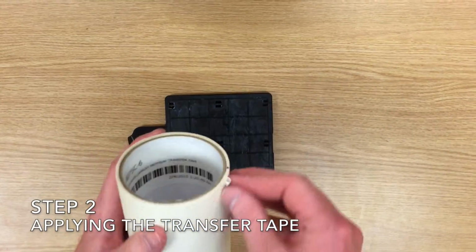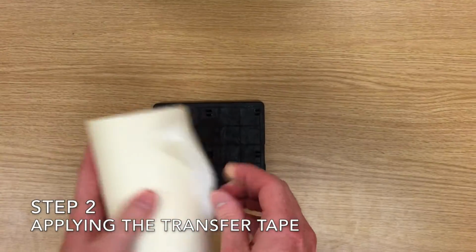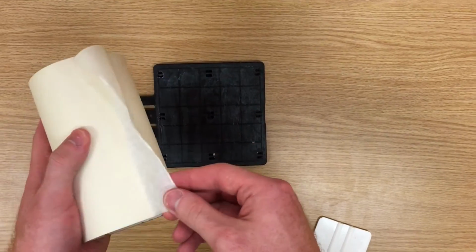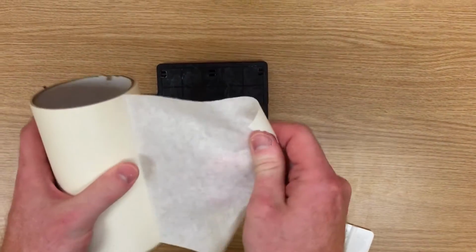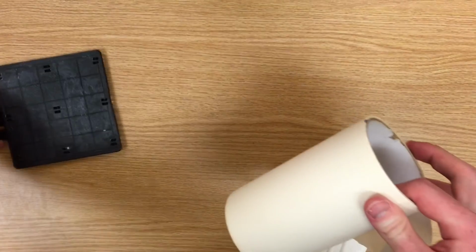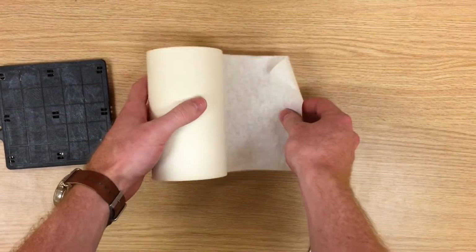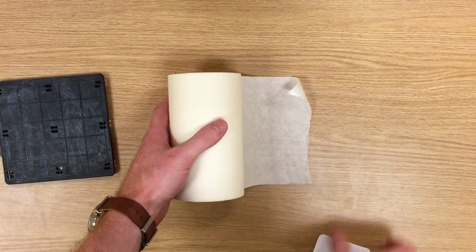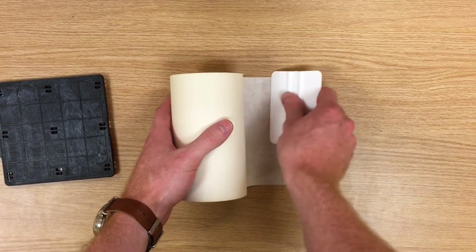Step 2 is applying the transfer tape to the build tray. Now, transfer tape is not masking tape. It is a little bit thinner and can also handle heat more than masking tape can. I have a link in the description where you can order the transfer tape from, and I recommend you order tape that's the width of your build tray. So for example, I'm using a 5-inch roll for my Mojo tray.